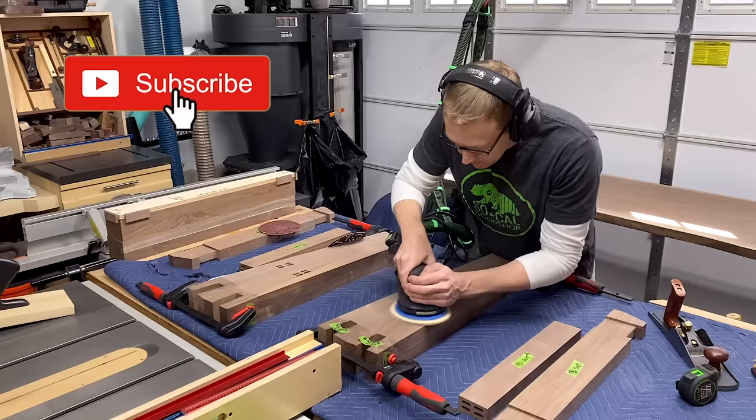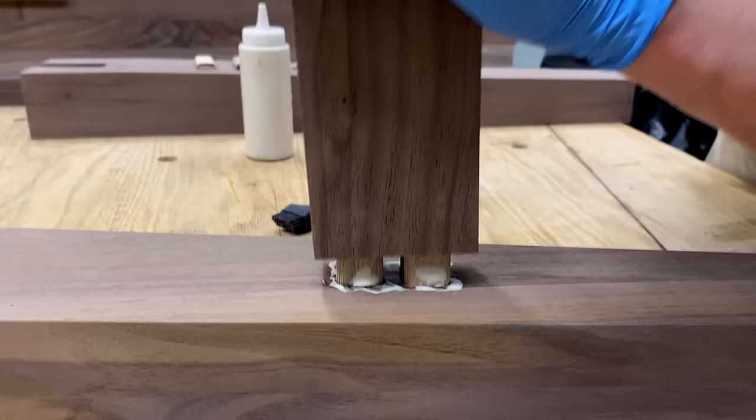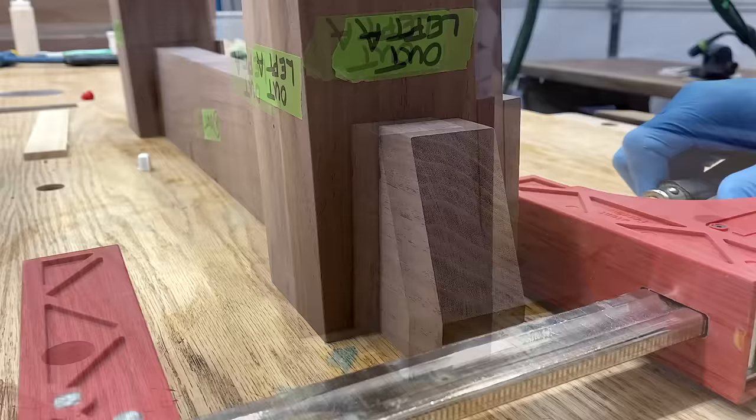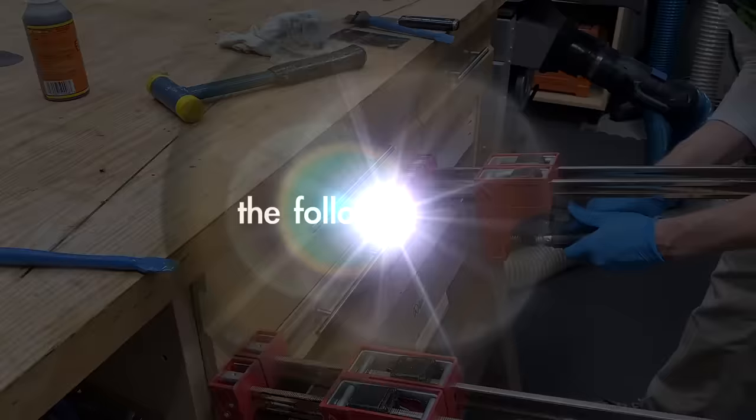While I do a little bit of sanding, don't forget to hit that subscribe button and the notification bell. For the glue-up I used Titebond 3 on the domino stretchers, but turned to Gorilla polyurethane glue for the bridle joints — PVA glue will swell the wood fibers and I didn't want to run into any resistance when clamping these assemblies together. The extra open time with the polyurethane glue is great, but it also expands two to three times its normal size and starts to foam up, so you've got to be careful.